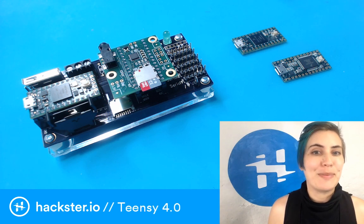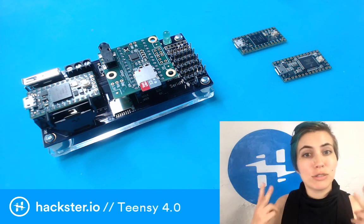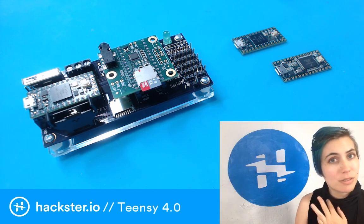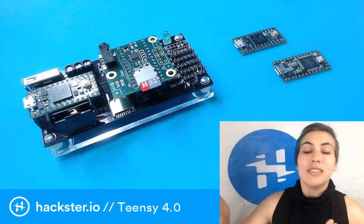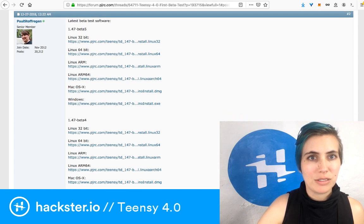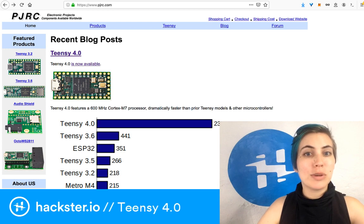I had to cut that one off because my Teensyduino install was not working. I realized that's because I had two separate installs of Arduino — I'm on a Mac — one in Macintosh HD slash Applications, and then one in my personal users Applications folder. I had to run the Teensyduino installer on a different version than the one I'm actually using. All the instructions are still valid. You can grab the software from this thread, which is linked in the description, or you can find it elsewhere on the Teensy site. All you gotta do is look for the Teensyduino installer.